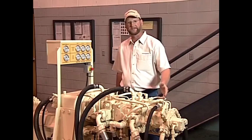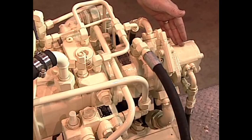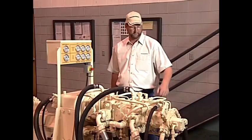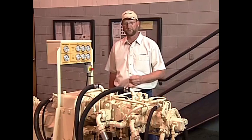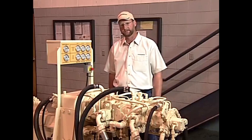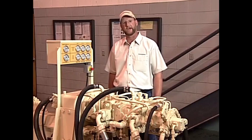The last pump in this stack is our agitator pump. This hydraulic pump operates our agitator circuit and our water pump circuit. It also sends oil back through our automatic valve, which controls the oil that we use to cycle the pump.